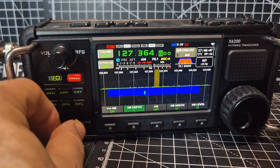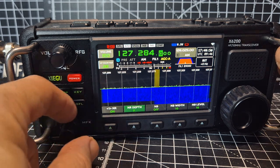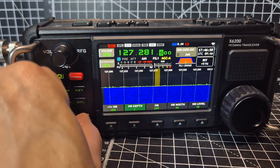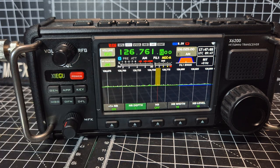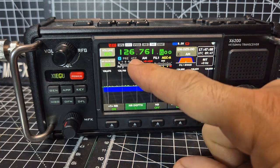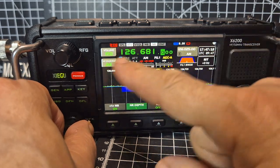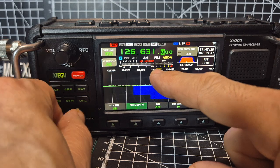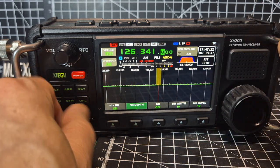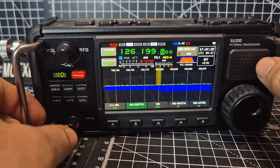Airband does work — there's something there. Let me just make sure we've got no interference. I'm unplugging my power supply because with airband, power supplies and phone chargers are going to interfere a bit, so have a little experiment. I feel like we should be doing change increments from here — megahertz, kilohertz — we want larger increments. But it's not that it's not receiving at all; let's turn the noise reduction off.